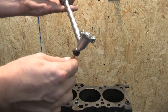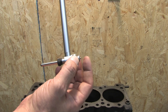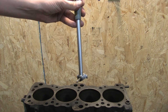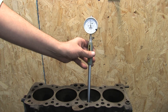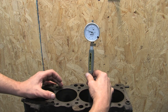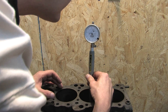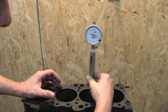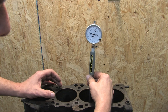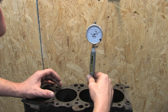The unique thing about this versus using telescoping gauges is that it has a spring-loaded guide that retracts far enough for this to make contact inside the bore. As these two pieces get squeezed together, the dial moves, so this keeps it well lined up to its widest point. You still want to take several measurements. You stick this down into the block and after you've got it in position, you pull the tool towards you and it begins to compress the needle. We've gone around one time, two times. We're getting readings of about .0233, .0231. You see how this works — you take several measurements and take your average.